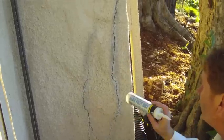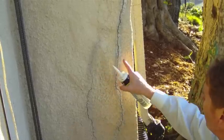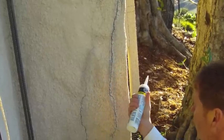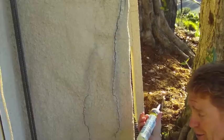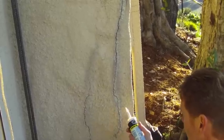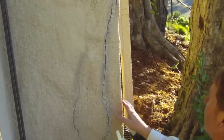Don't use a silicone either, because silicone will fill this and won't shrink as much, but if you use silicone you can't paint it. Silicone is great for a fish tank but not for this. Now what I did is I cut my tip just shy of a quarter inch — that way I want to go in the crack, not just on the surface.